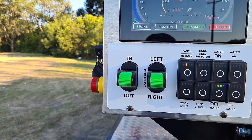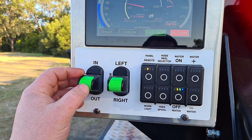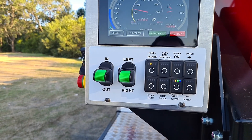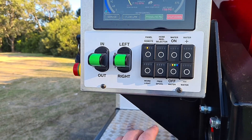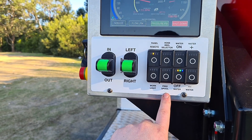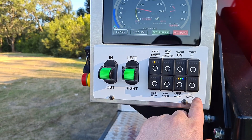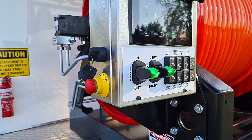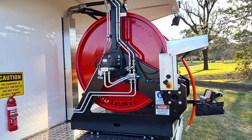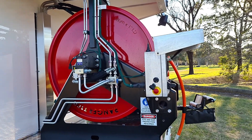The hydraulic system on this truck is fully proportional — it's got a load sense hydraulic system and a variable displacement pump, which means that the more you push the lever the faster it goes, and that works the same on the remote control. It's a much, much nicer system. You've also got your small hose and main hose selector switch, your free spool valve, work lights, water on, water off, and your up and down. Around here you've got an e-stop, and there's also an e-stop on the other side of the reel. All the hydraulics on this truck are super neat — they're all done with Stauff hydraulic tubes. There are hardly any rubber hoses on the truck to fail, which makes it a lot safer and a lot more reliable.